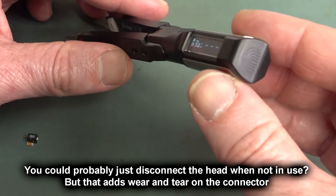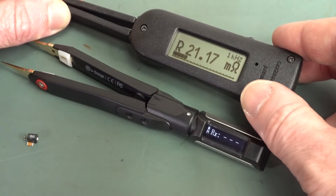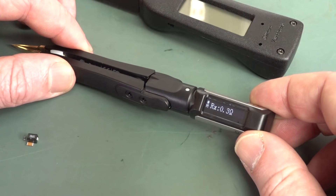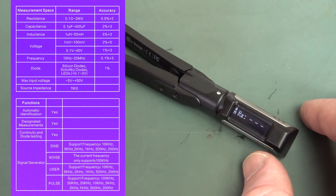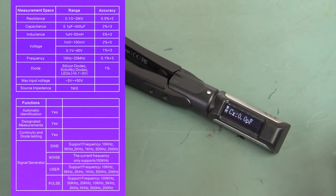To go into settings, you can just hold down the touch button at the back. One of the downsides is it doesn't really have the resolution of the Advanced Devices Smart Tweezers. That one can measure down to like 20 milliohms with 10 microohm resolution, while the DT-71 gives you 0.1 ohm resolution — so it's not terrific. For resistance it's 0.1 ohms to 2 megohms at ±0.5% plus two digits. Capacitance has only 0.1 pF resolution up to 400 microfarads — so not good if you want to measure big caps.